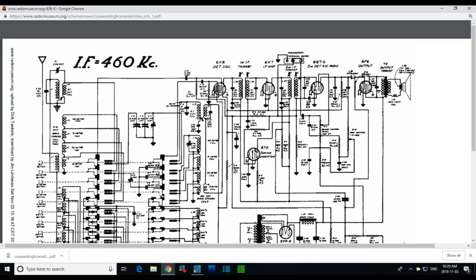So let's go in and try to measure this grid potential here. The problem with doing that is my voltmeter, the best ones I have, are 10 megohms. Well, that's not so bad. If this is a 1 megohm resistor here, maybe hooking up 10 to ground here isn't going to make much difference. That's how I got the 2 volt measurement before. We'll repeat that, then we'll go right after this capacitor next, I think, because by then we will have found it and we'll know what it is. We'll cut it out, test it, put a new one in, and retest the voltage here and see what's happening. That's step number 1.